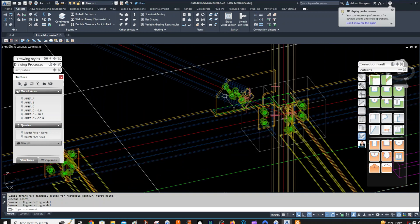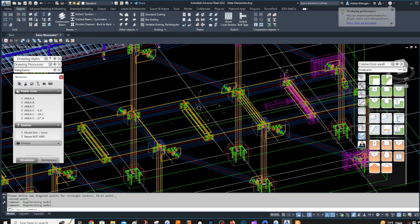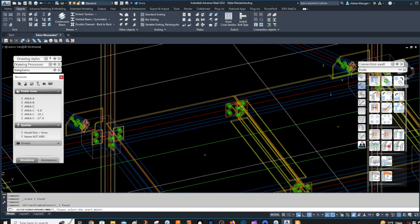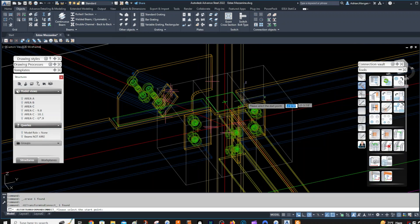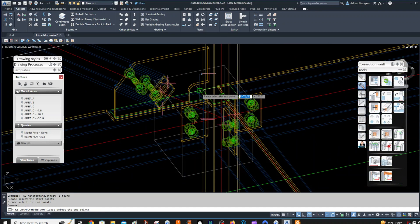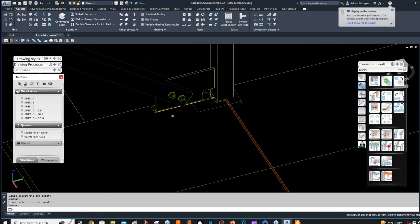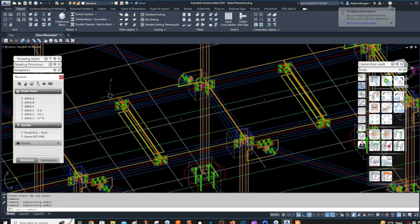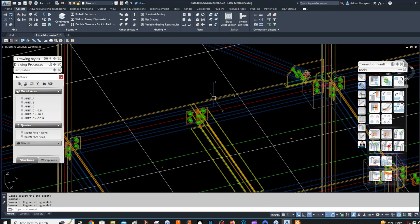You can see now that plate is good. These are all the same, so in theory these beam spaces are the same also. In theory I could copy this over — let's see if I delete this and copy it from the end of the beam. These connections are the same so the end of the beam should be in the same place, and that appears to be correct. But there's not the same space here — so that is not correct. We're going to go back.